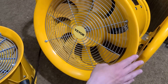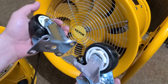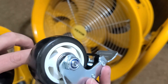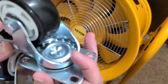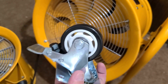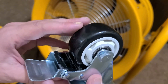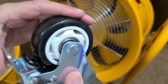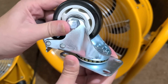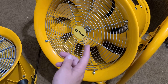This is on a carriage and it comes with a whole bunch of casters — three fixed casters and three swivel casters. These are actually not bad: they're dual ball bearing on the wheel and dual ball bearing on the swivel, with bearings on both sides. They are proper locking casters — not only do they have a tang that goes against the wheel to lock it, but they also have a little fork so it prevents the caster from swiveling at the same time.